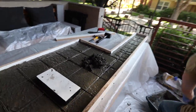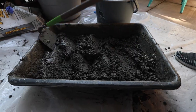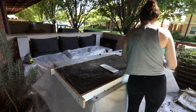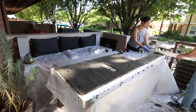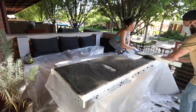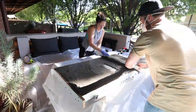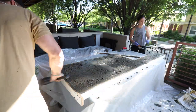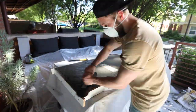Then continue to fill and pack the mold with concrete all the way to the top. My wife Christina would pack the mold while I mixed more concrete. You want to overfill the mold then screed the top with a spare piece of wood — just scrape it back and forth over the top of the mold to remove any excess concrete. Once again vibrate like crazy. I did a quick pass with a rounded trowel and then decided to screed once more.